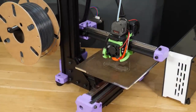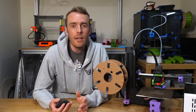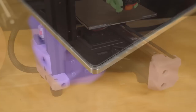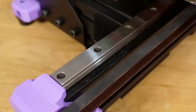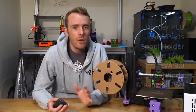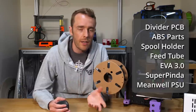It's a mini cantilever style printer with a 180mm cubed build volume, sold by RatRig who are based in Portugal. It has plenty of bells and whistles like a flexible build plate, thick aluminium bed, 30-30 extrusion frame, a Phaetus Dragonfly hotend, mesh bed leveling, input shaping, and pretty thick massive linear rails. My specific V-Minion is modified a little compared to the original, so I'll cover those differences as we go.